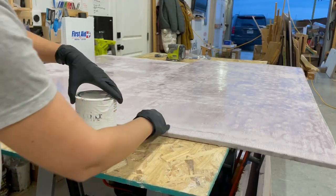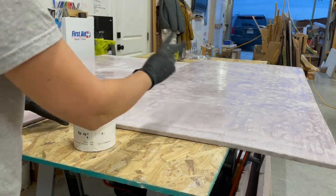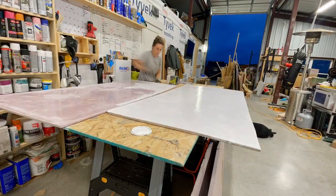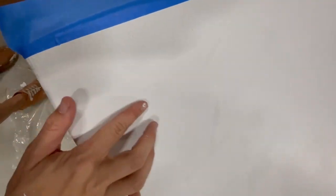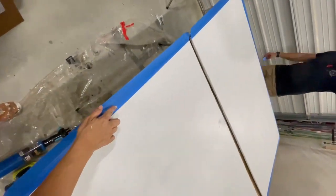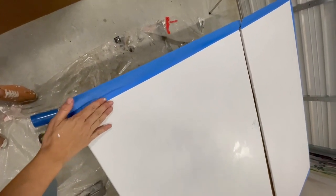It all feels smooth now. This is an epoxy coat — I'm gonna put this undercoat on, let it dry, sand it, second coat, and then the epoxy. We painted this three coats and I like it all white. Then we do tape and a little weather stripping to create a dam so that gives our epoxy some time to set up before we pull the tape.